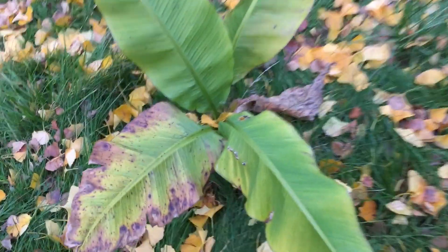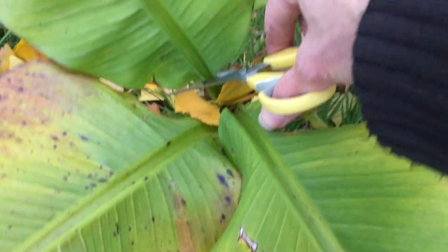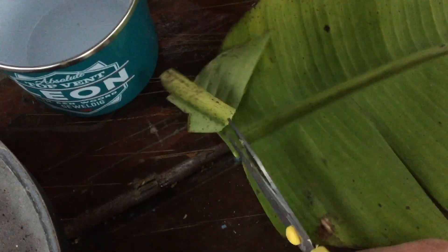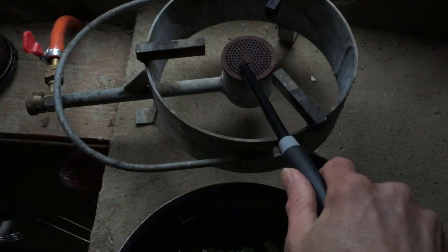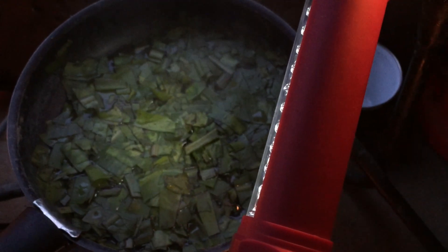There's just one thing I want to add to the test, so we're going over to my man cave to cut some baby banana leaves. This idea is using the Ghana technique. One way to prepare this substance is to remove the stalks and leaves from the plant, cut them into very small pieces, and submerge them in a 40-gallon drum in a ratio of 2 parts cut-up pieces to 1 part water. The mixture is boiled and the ingredients mashed periodically until the substance thickens. The remaining heavy material is then filtered and applied, achieving good protection of the rendered walls for about 3 years before reapplication becomes necessary.